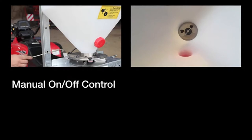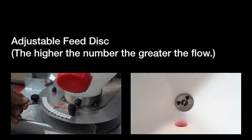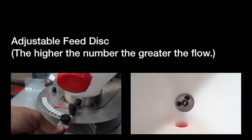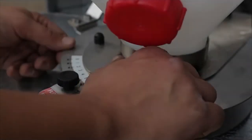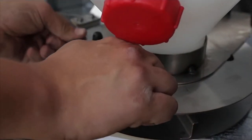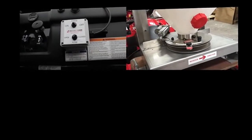The output is controlled by the manual lever, which opens and shuts the slide covering the two apertures, allowing the contents out onto the disc. A separate flow rate control has 12 different setting positions, giving the ability to apply application rates between 2 to 50 kilograms per hectare. It is also possible to change the bias setting on the machine to ensure the contents are spread evenly.